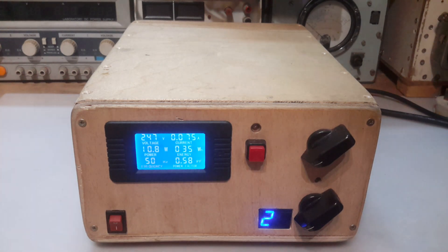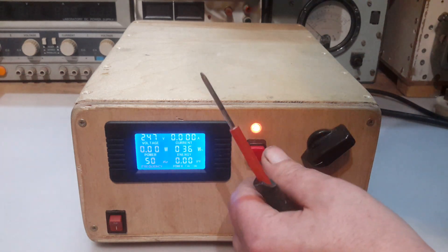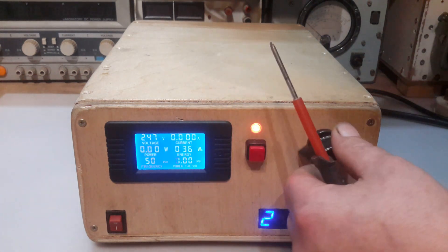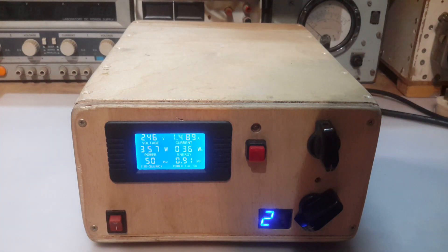I'll just show you a little look at it tripping. I've got a kettle here plugged into a variac so I can change the load. I'll just wind it up a little bit and you'll see — 100, 200, 300, yeah 500. It's a little slow to respond, that meter, but trust me it's 500 milliamps. And the maximum current is 9 amps, so I'll just wind it up to 9 amps and show that.